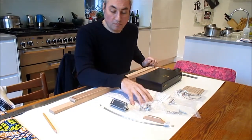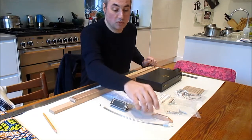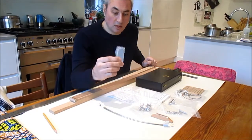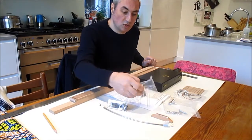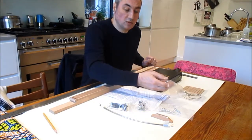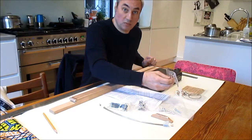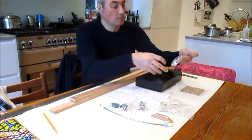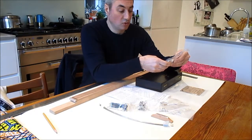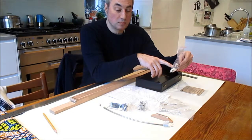And then obviously we've got the hardware kit here: fret wire, a little wooden saddle with a fret wire across it, which is a nice touch because it means you can earth all the strings from one string. A little humbucker, some nice looking tuners, bits of hardware, a bolt for the nut, side dot inlays with the drills to go with them, which is a nice touch, and then pots, including a capacitor in here and some wires, and a jack for the tone and volume control. Quite interesting, these are very small pots, much smaller than I'm used to.